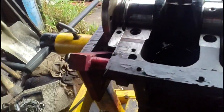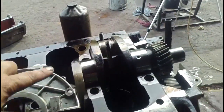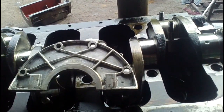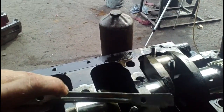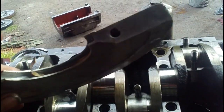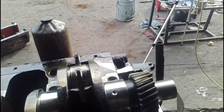There was another issue I also saw: the rear seal retainer plate is warped up in here. It's got a 1/4 inch lift away from the block, so that's certainly not going to help anything. And they went and put a shim inside the groove for some reason, to try to tighten up the seal, I guess. I can't imagine that's being helpful either.